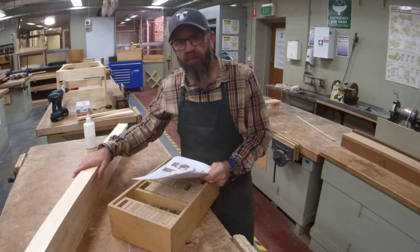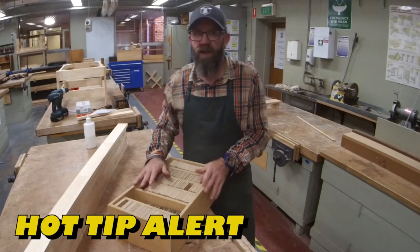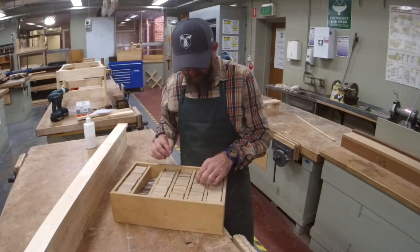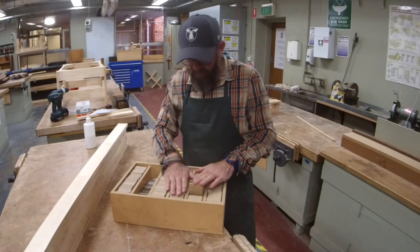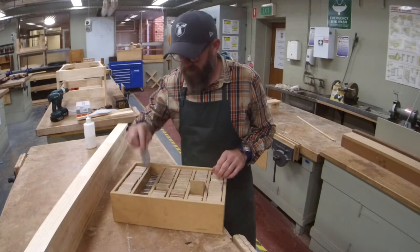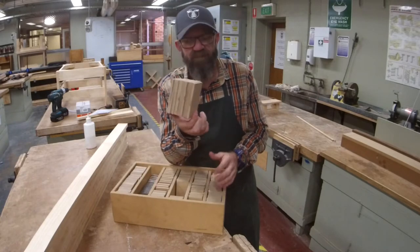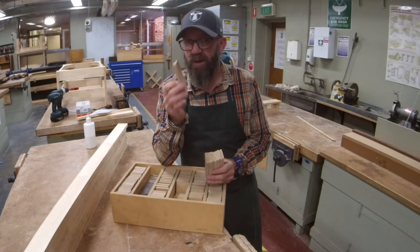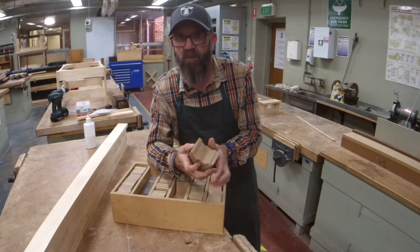Thicknessing done, I'm going to show you how we assemble the tabletops, the simplest way you can do it. But I've got a hot tip. And you may need a really good friend. A good mate of mine put together this for me. It is a box of different sized MDF spacers. I've got my 3s, 5s, 9s, 12s, and really, really skinny ones. For this project, we're using the 6 mil spacers. Super handy, even if you had to cut up a few 6 mil bits, whatever you could use for spacing would be perfect for this project. You'll see why in a second.